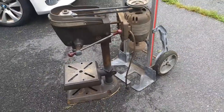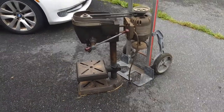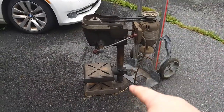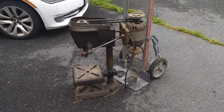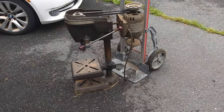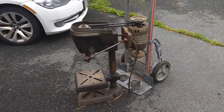Let's try and get her inside. I'd like to get her cleaned up a little bit. The main column here on the back could probably use a good brake clean and steel wool, and then a coat with some light oil or WD-40 to keep it from corroding. Then we'll see if we can make her pretty.